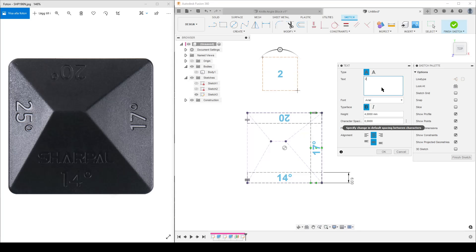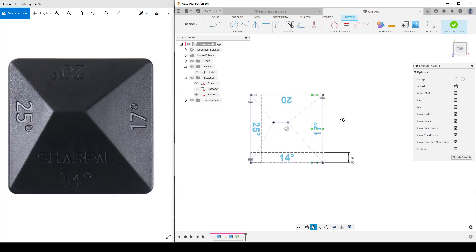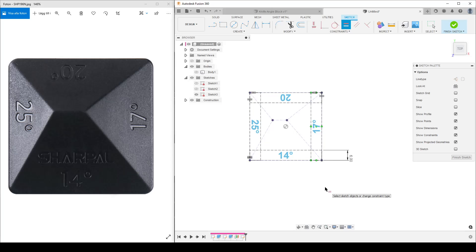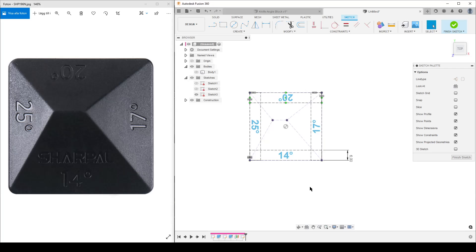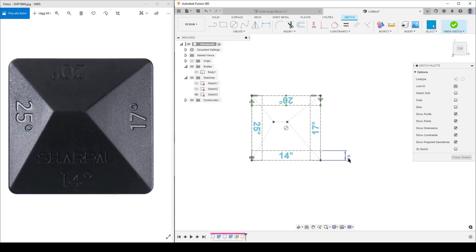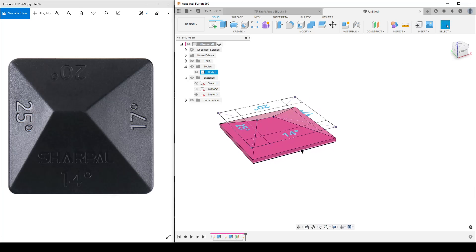I'll add degree signs to all the text entries. Looking at the sketch, I'd like the text further in from the edges, so I'll change the offset dimension from 6 to 8 — that feels better. Finish sketch, turn on the body. Now I want to extrude the text into each angled face straight down. I'll start the extrusion from each top face object so the bottom of the cut follows the face angle, not a flat depth. I'll name the parameter 'text_depth' = -0.5 mm.